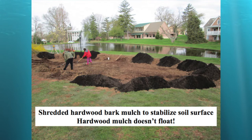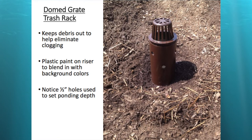The brown mulch in the bottom came from the maintenance facility's mulching operation. We bought shredded hardwood bark mulch to put on top — the reason being that hardwood mulch doesn't float. A lot of problems with rain gardens is that mulch floats and goes over to the riser, clogging the holes. On this project, I let someone else be in charge of buying and installing the dome grate — and it never got done. So the first huge rain event, large floating mulch got stuck in the elbow and clogged the pipe on the inside due to the lack of that dome grate.